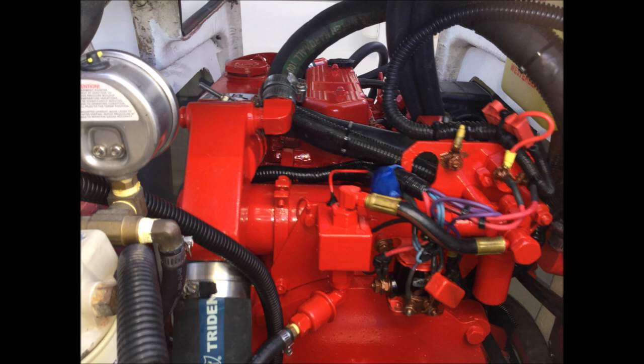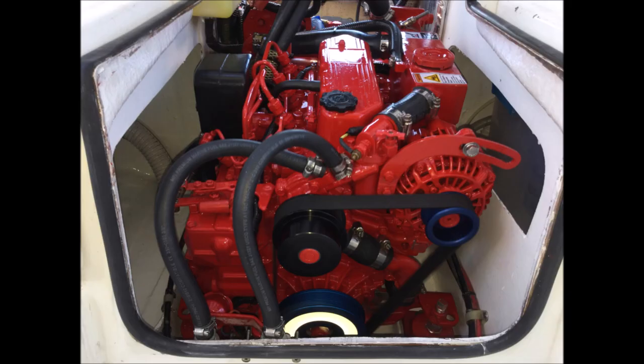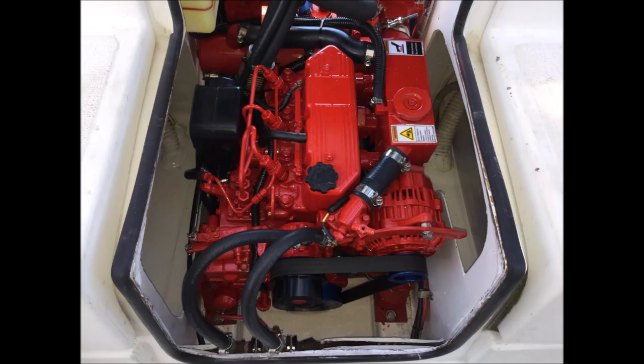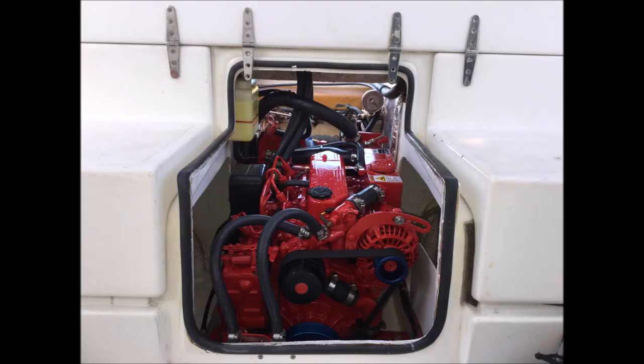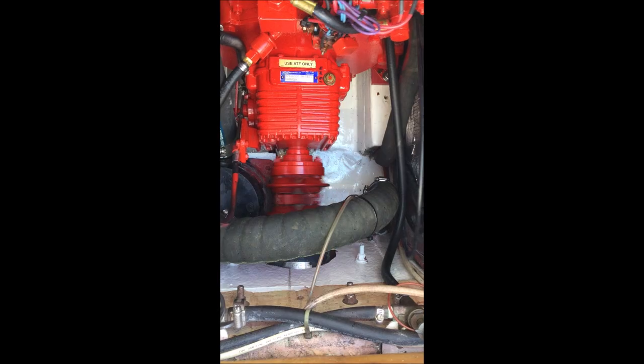It was still possible without pulling the engine all the way back out. I had great difficulty trying to get the engine aligned — despite all efforts, I could not get it any better than 30 thousandths in the vertical plane. Because I could not get the alignment correct, there was a huge amount of vibration at the rear of the transmission and rattling noises, as the next video will show.